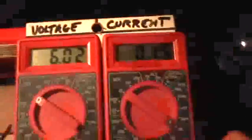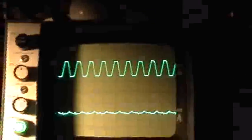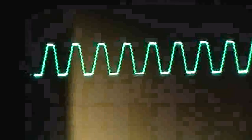It's a standard ring oscillator, powered by the high-voltage AC output from this jewel thief here. That is the input voltage and current value right now — something less than one watt input. The waveform: the top trace is the output at 200 volts per division, so that's almost 400 — about 320 volts. The bottom trace is the input current monitored across a 0.22 ohm current viewing resistor.